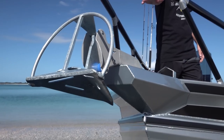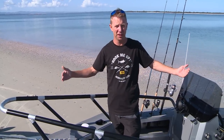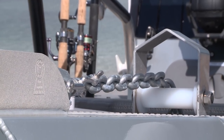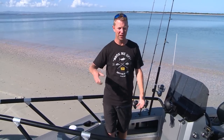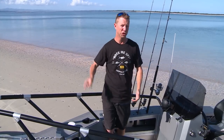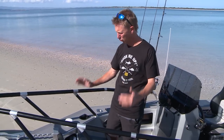Starting at the front with the Sarka anchor — I choose the Sarka for its holding power. I've got 10 metres of chain, always going double the boat length. That feeds onto a Maxwell drum winch. A drum winch is so much better than a windlass — the chain doesn't tangle or jam, and it's got great holding power without needing to clean it off.